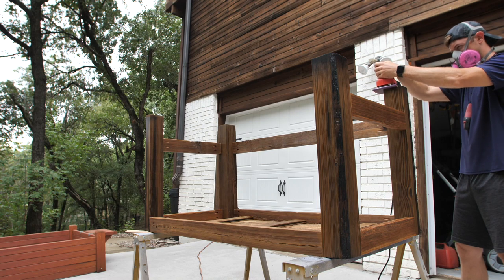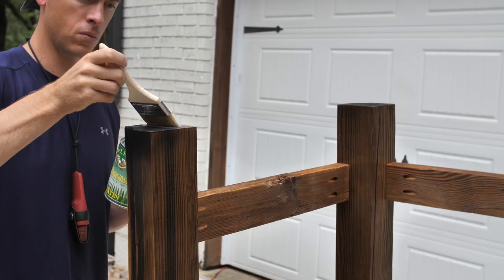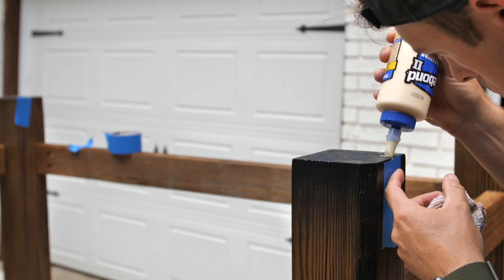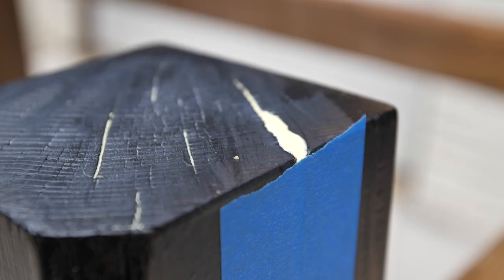And I felt good with the top, but when I flipped it over, smell was coming out, so I had to sand that down. And then I went with wood glue to fill in a lot of those cracks, let that wood glue dry, and then go to a clear epoxy, fill in the cracks so that smell and that stuff is not leaking out of there.